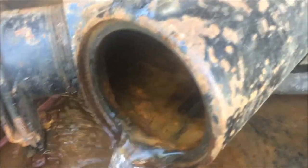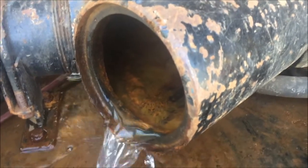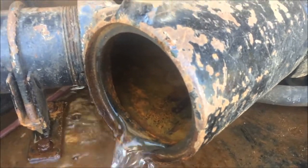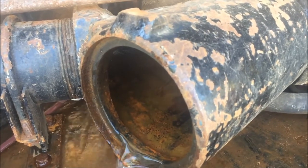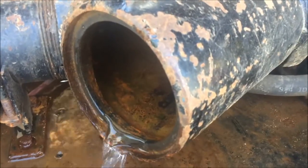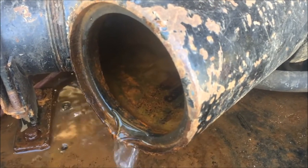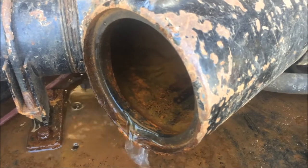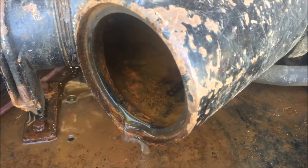You want to make sure that screen is clean so that the pump can get proper water flow. Otherwise it gets restricted and you'll start losing pressure. It'll almost feel like you've got air in the system — you're going to see some knocking going on, but it's a little different. You might have good pressure at low RPM and then when you bring the RPM higher, you might notice that your pressure doesn't increase or it actually starts to drop.